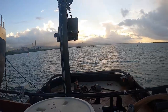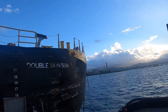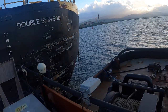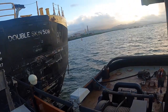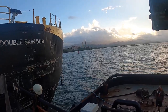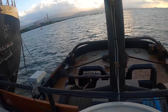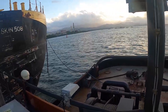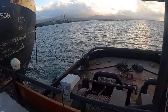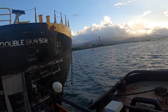They're getting ready over here. Now that he's got it all shackled — our line into his line — he's pushing it over the rail. You can see ours falls into the water when he gets done. It's going to hang down right now, but he has his line tied off so he's holding all that weight of the pennant up. He's going to let it go and you'll see our line go into the water. Luke is heaving up on the suitcase drum just so when it goes we're all set. The chief has the chafing gear around the wear point of where it makes the bend around the cleat down there. So now we're just waiting for the tankerman to let everything go.